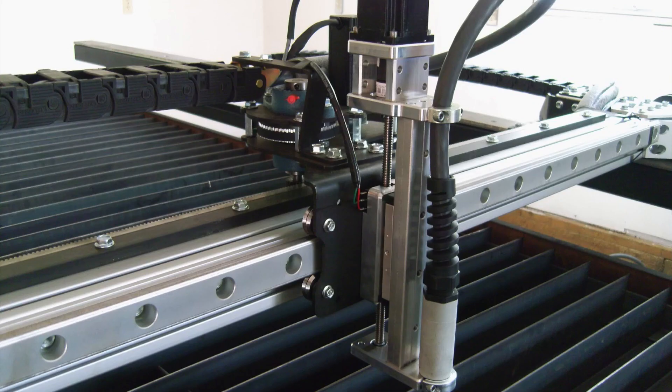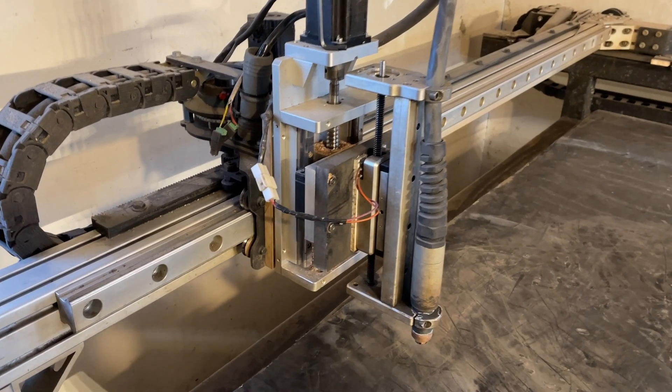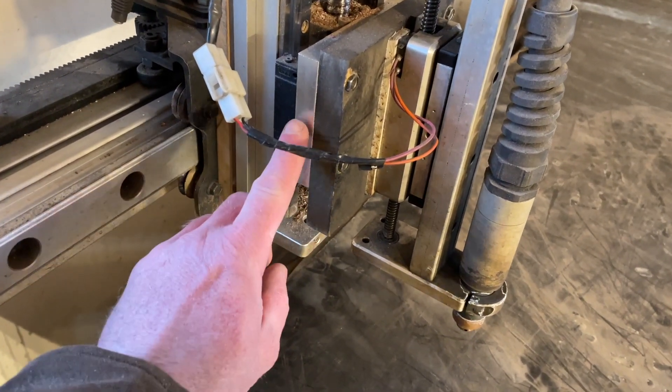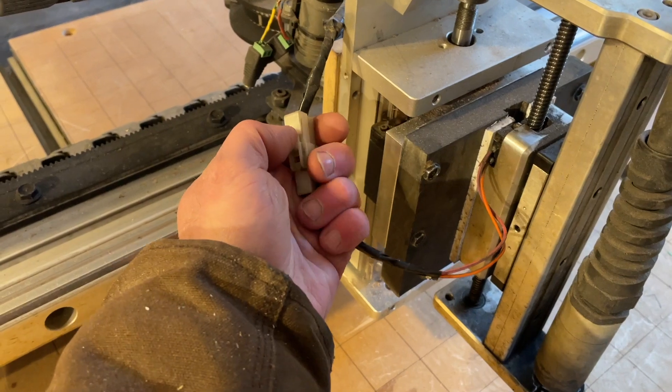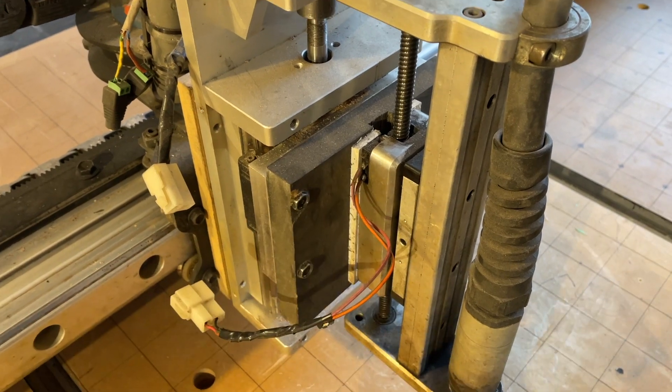Here is a picture of the original Z-axis assembly. I had to make a system that would allow me to switch back and forth between the plasma torch and router. I ordered from eBay a linear rail ball screw module with 100 millimeters — or four inches — of travel. My existing stepper motor could be mounted on this new assembly. I made an adapter plate utilizing MDF to mount the old plasma assembly onto the new ball screw module. I put an electrical connector on the wires connecting the micro switch of the floating head on the CNC torch so it could be easily disconnected and reconnected.